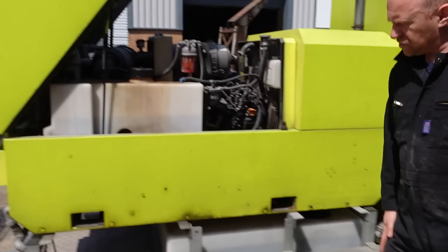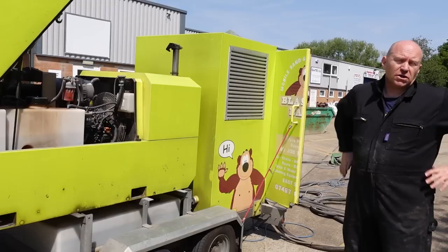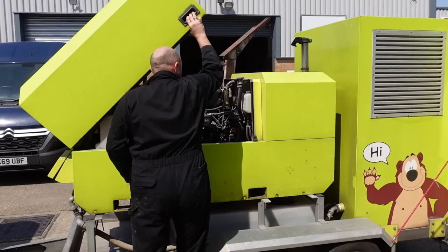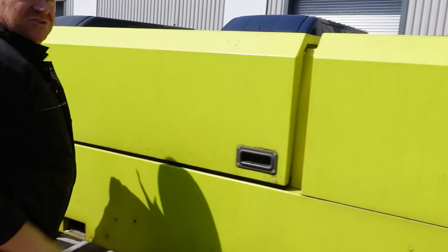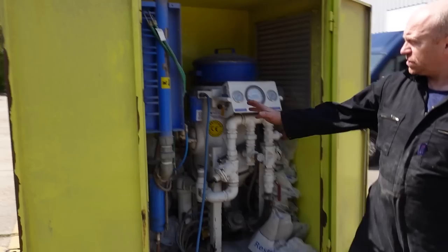That's the minimum needed to run the 60 litre pot in the back of the machine. Underneath is a 250 litre water tank. So if you're working on boats and fibreglass or working on a building, you can do everything wet - it's basically just a reduction of dust, not like a pressure washer, it just keeps the dust down. The air has got to be bone dry otherwise it won't work. It's just a constant volume of air - that's what the compressor does.